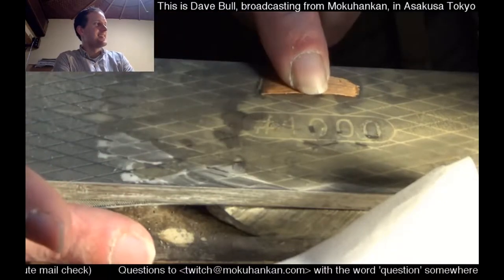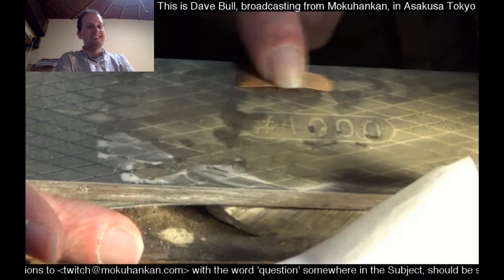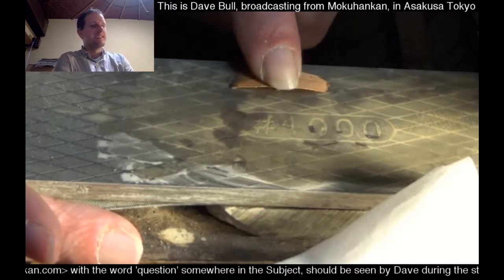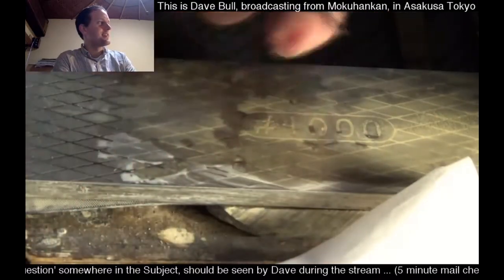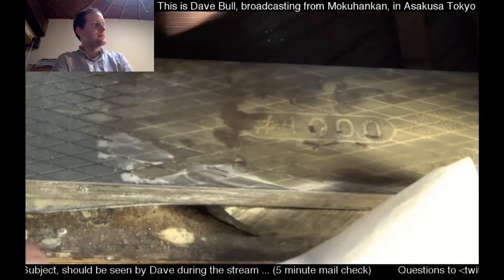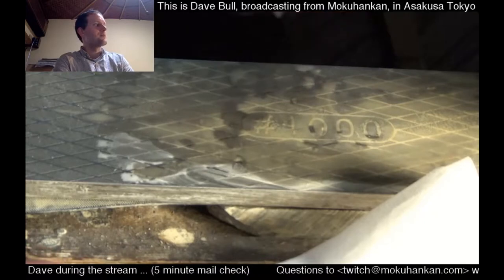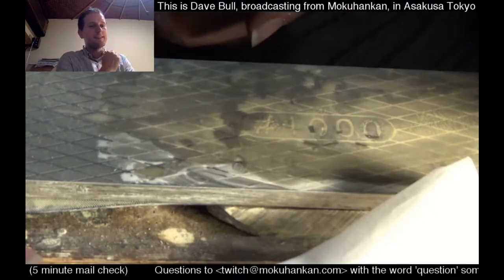He just did it. But he looks over to me, are you getting this? And there it goes. Now because of the outriggers, it stays flat. When you've looked at this, you've taken off your burr, and the back of that thing is now flat. And you only need that for the ones that are like 1 millimeter or so. The wider ones don't need that because you're not in any question of rocking back and forth. So that's it.